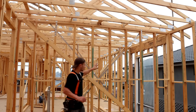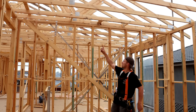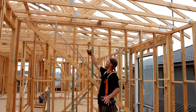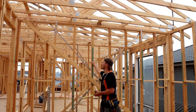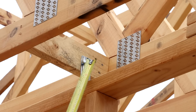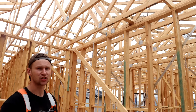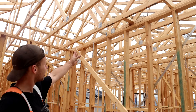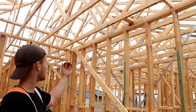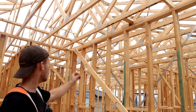With this internal wall behind me we've got a cross brace which braces it and stops it moving side to side. To stop it moving in and out we have little brackets called L brackets — right angle brackets up there whose purpose is just to get nailed to the top plate of the wall and then to a nog between the truss, stopping the wall getting pushed in and out. You can see these blue nails go into the L bracket through a long cut up and down the bracket rather than a single nail hole. That's really important especially for a tiled roof — when all the weight of the tiles is on the roof it will sag a little bit. Those brackets are designed so that when the roof sags down, those nails have room to move up and down, meaning that won't turn into a load point and the load won't get transferred to that wall below.